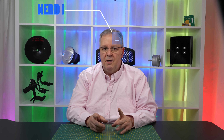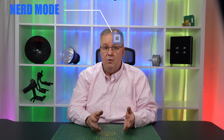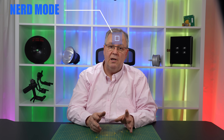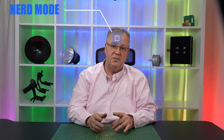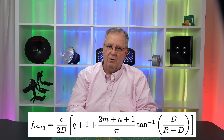At 47 GHz with 180mm radius mirrors spaced about 300mm apart, the frequency varies by 150 kHz per micrometre of offset. That's less than the half power bandwidth of the unloaded cavity. The equations for relative permittivity and loss tangent are scary looking.